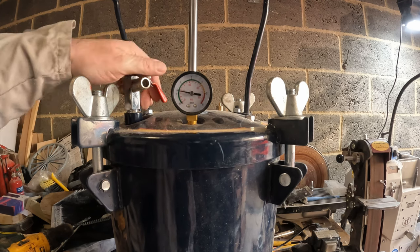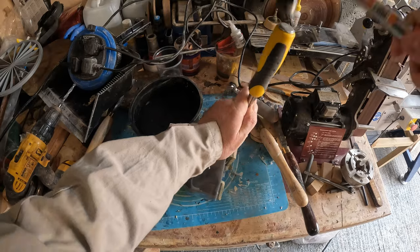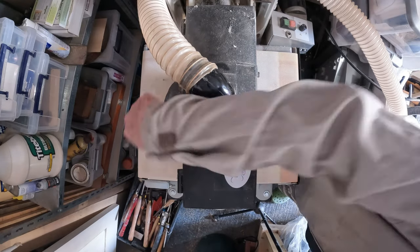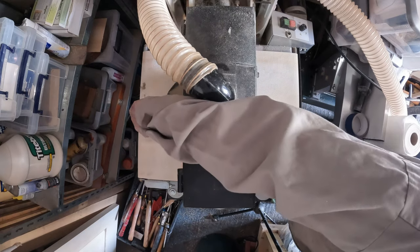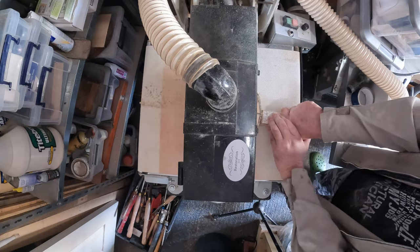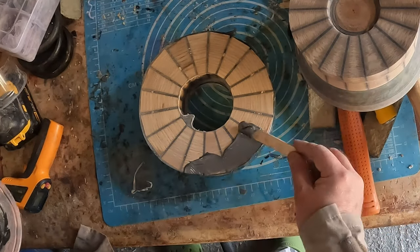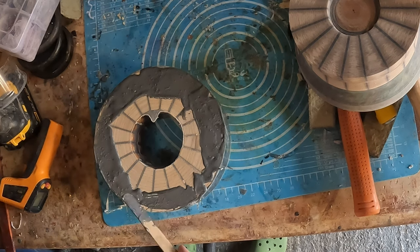The next day, with the rim removed from the pressure pot and its silicone mold, all was well - no voids or cracks. The first thing was to pass it through the drum sander to expose the ash segments, which only needed one side done. Then I used rapid-setting epoxy colored with steel silver mica powder, applied it to the rim, placed the heavier blank on top, checked the joints were aligned, and left it 30 minutes to cure before going back on the lathe to begin shaping.